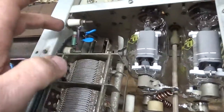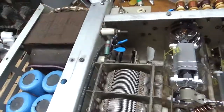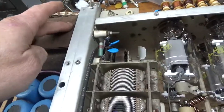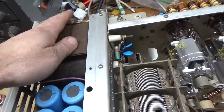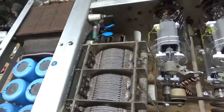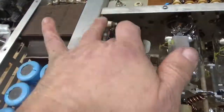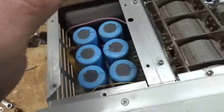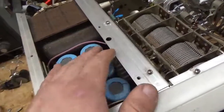I had to change the caps over here. The interlock's broken, and in order to change that I'd have to take the transformer out — a lot of work — plus I don't want to risk damaging the old wiring, so I'll make sure the owner is aware of that. I changed the two disc caps; one of them was damaged. Someone already changed the filter caps — they test good. The filter has an aftermarket board in here.